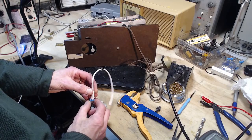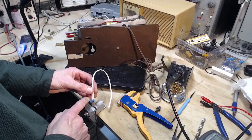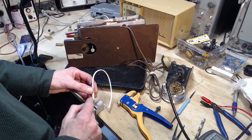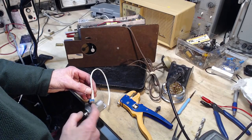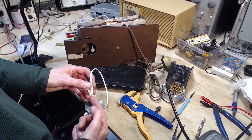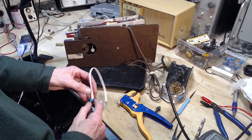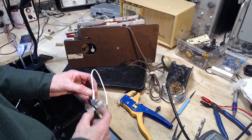Even this terminal is a bit of a problem, isn't it? It depends how I hook this wire inside the radio. Switch is open, I want this terminal to be the live one and this one to be the dead one. Otherwise, if this is the live one, the switch is open here, it's closed there, and that terminal becomes live. So the guy turns the radio off, goes, hey, that'll be safe, reaches around the back, yahoo!